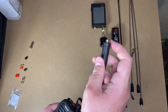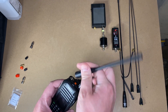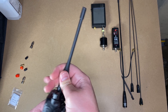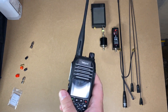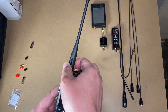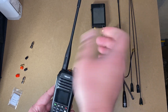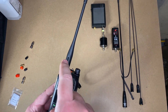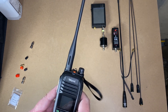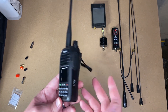Also, this stock antenna when I got it had extra plastic from the extrusion process around it that I had to trim off with an X-Acto knife — no big deal, but aftermarket antennas, good luck. If you're thinking 'why not just use a BNC adapter' — that's what I normally do with every radio. I put a BNC adapter in there and just swap them in and out. The BNC adapter does the same thing — it cannot sit low enough to make contact. So if you get one of these, you might be stuck with the stock antenna.